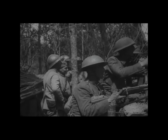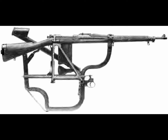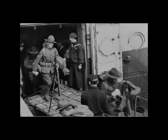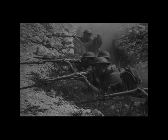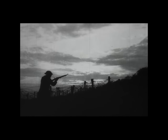World War I created many advancements in firearms technologies. As trench warfare had become the new norm, rifles were modified to help increase soldier safety — such as stocks that folded down and periscopes for rifles — and increased magazine capacity. In 1918, U.S. air crew were issued a 1903 with 25-round fixed magazines. During World War I, some very important issues were found in 1903 receivers: some receivers were becoming damaged due to improper heat treatment and could potentially be dangerous to soldiers. In December of 1917, pyrometers were installed to accurately measure temperatures during the forging process. For Springfield Armory, this change came around serial number 800,000; for Rock Island Arsenal, the serial number was 285,507. Serial numbers above these are known as double heat treated.